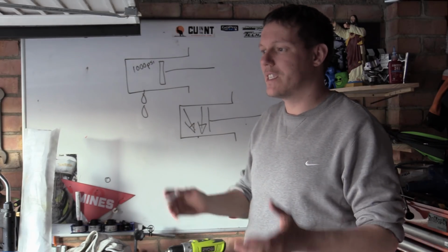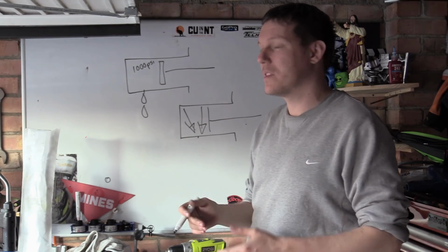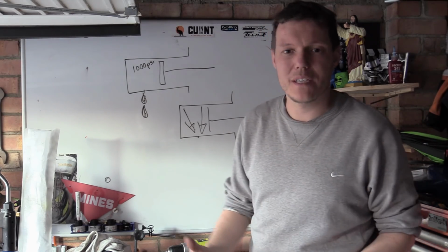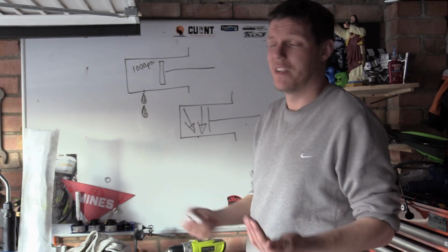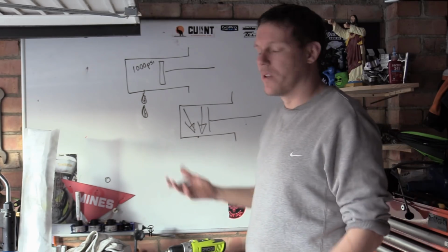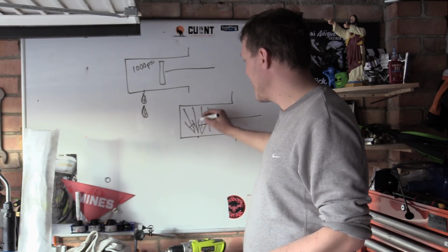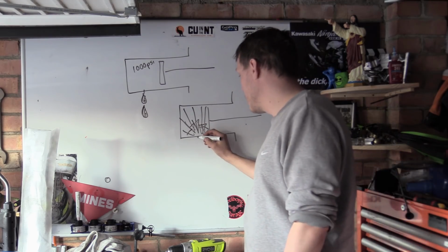With hydraulic systems, as soon as they bleed off the pressure, as soon as that pressure drops, and that pressure can be literally, you make enough room for two drops and then the pressure just drops out. This is the difference between compressible and incompressible fluids. I say incompressible, they are compressible, just like you can compress steel. It's just that relatively, oils are practically non-compressible versus gases. The problem is that all of this air just tries to rush out like this. And generally what happens is it causes tears.